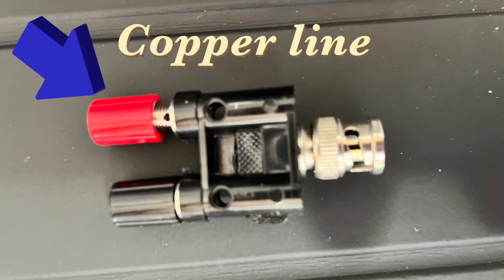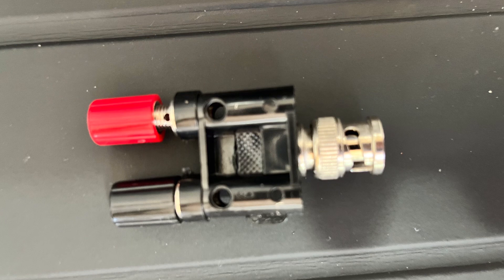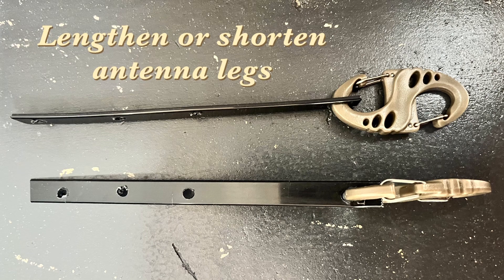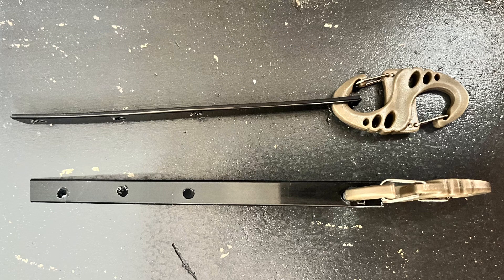Next, I connected the other end of the antenna to this dual female banana plug — I'll include a link in the description. I simply used some zip ties and drilled some holes for insulators. Guy lines can attach to the S hooks, and then you can attach your antenna to the holes in the zip tie and tie off each guy line. When you tune your antenna, you can fold the wires back through these holes on the zip tie to make it resonant before cutting it.